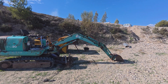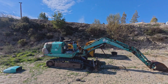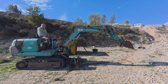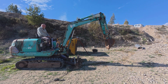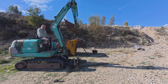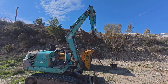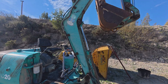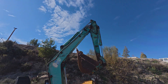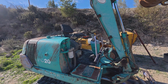That's the correct position for the arm and the boom to check the fluid level on the reservoir on the side of the digger. Now we're going to raise it up to the point where you pressurize the system. And there you have it — that is the position you need to have your digger arm in to pressurize the system. As you can see, all the hydraulics are fully extended — on the bucket up there and on the arm up there. All those are fully extended, so now we're at the final stages.